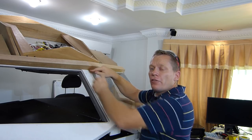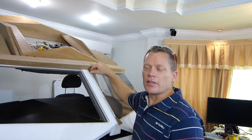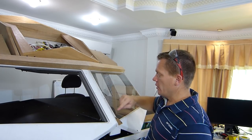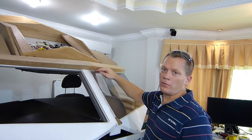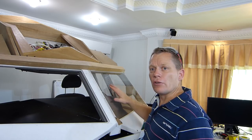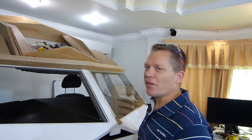I've just applied a little bit of foam tape just to hold the window in. The window frames were designed for five millimetre glass and of course I've used three millimetre, so there's two millimetres worth of play. Ideally what would be nice would be to fit a nice foam sealed tape around the outer edge, just for a bit of cushioning. But when I find some, I'll get round to doing that.